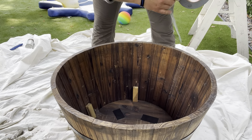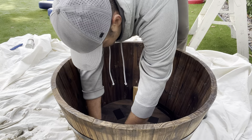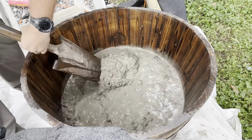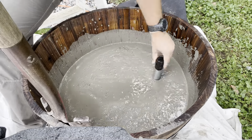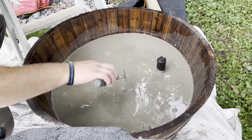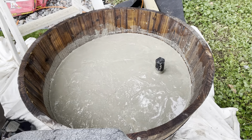Now it's time to do a little prep on the barrel. I'm putting tape down along all the edges so the water from the concrete doesn't seep out — I learned that on the first one. This is the second one I'm doing, and I'm taping it up nice because the first one had a little too much water coming out the bottom. Time to put in the concrete. Mix it up, put in one bag at a time, get to the moisture level I wanted, and keep going until all four bags are in. Once that's in, I put in the twelve-inch steel pipe sleeve for the big pole, get it level, smooth out the top with the trowel, and let it set. Once it's fully set, we can do the prep work on putting the poles in.